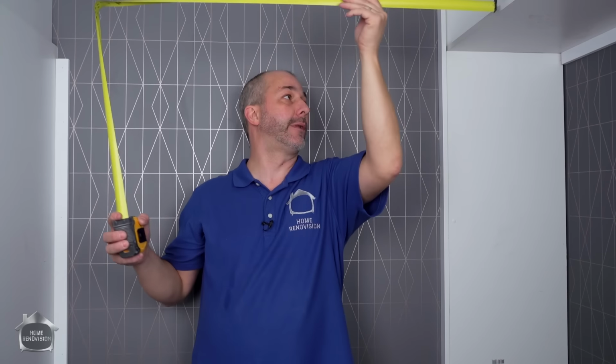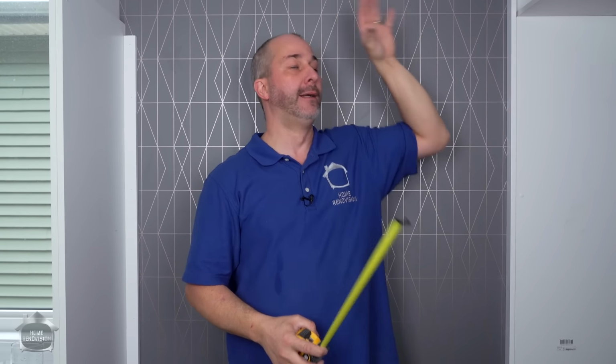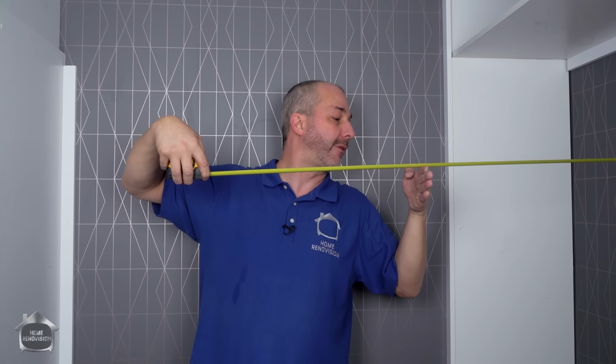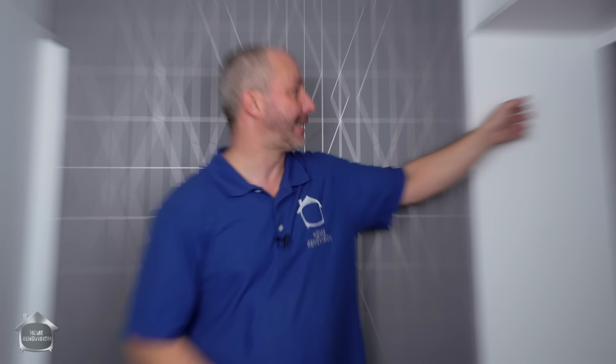So what we want to do is measure and install our shelf and our gable at the same time. We want to cut the gable so that we can put it in a position where we want it to carry the weight while we put this in and attach our mending plates. It's a little tricky, but we'll get there. But the point is we want this gable here 24 inches off the wall. Okay? Make sense? So the gable, again, is going to be a standard stock item from the store, the same as the other two.